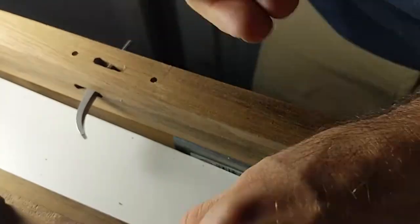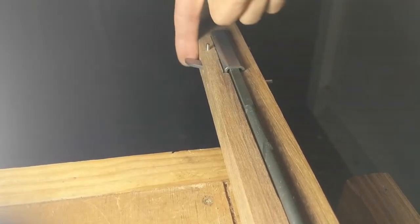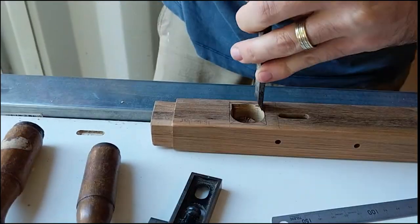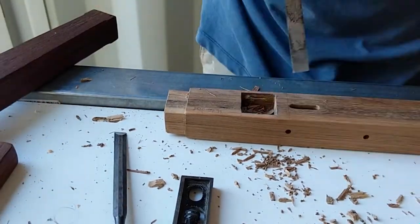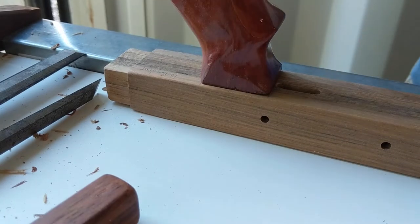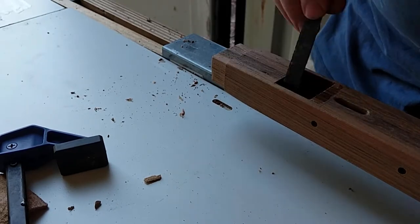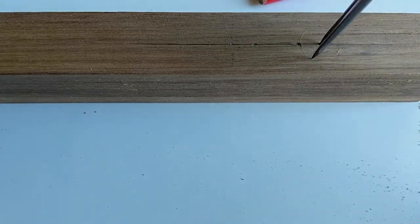The same for this top pin that locates the line release mechanism — I used the dimensions from my prototype to transfer over with a jig and got this locked into place. Once the spear shaft is locked in, that line release shouldn't move until the trigger underneath is released. Moving on to the mortise and tenon joint for the handle, replicating the method I used on the prototype. I gave the handle a UV stable marine grade spray varnish — several coats — so that it won't go yellow and will stay nice and clear, just highlighting the colour of the timber.